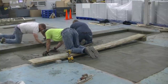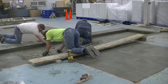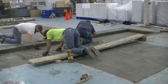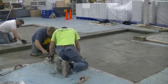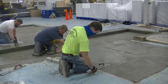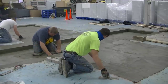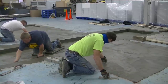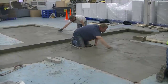You can see all those grooves in there that Luke — really all of us — had to fill. Luke's coming down with those knee boards, magging that piece out, getting it all nice and smooth. We were quite busy for a little bit over an hour getting all the forms out, getting all this stuff filled back in, getting it looking real nice, to where we could start just hand troweling it — going over it by hand two or three times to get it nice and smooth.